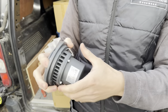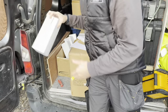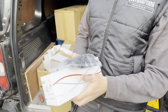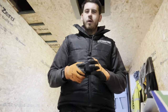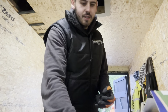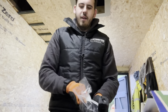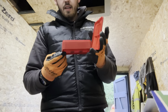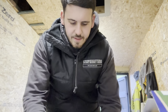We've already got some four-inch duct installed into the ground, so we're just going to push them in. You've got your LED and it shines out. They're pre-wired, so we just need to get them all wired up. We have got some Wiska boxes — just small ones — some Wiska glands, stuffing glands as well. We're going to get them all WAGO'd up and boxed up. What I'm going to do is start making up the Wiska boxes, prepping them — one in each side and one coming out the bottom. We've also got this little tool that Wiska sent out.